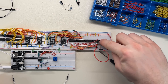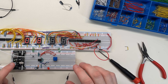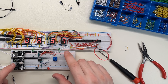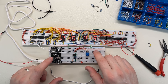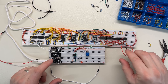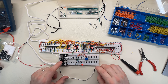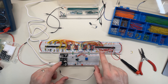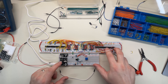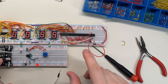Okay, so the down signal on this chip is now tied high permanently, which is how it was before. That was interesting — it was blank for a while and now it came back. That initial blank was strange but the behavior after that doesn't change. I'm going to tie the down to low now. Wow, that's really wrong. That's interesting — why does it start sort of wrong for a little while? I guess they could have garbage state in them because I'm not clearing them — I don't have a reset circuit yet.